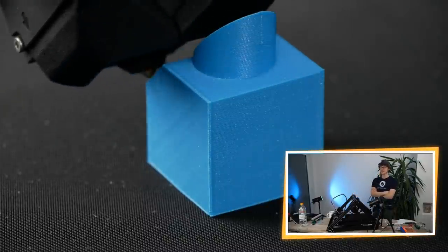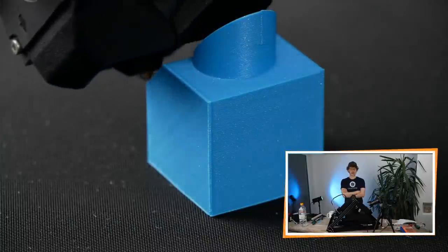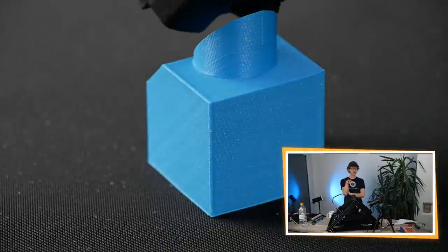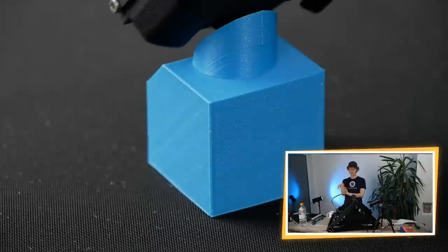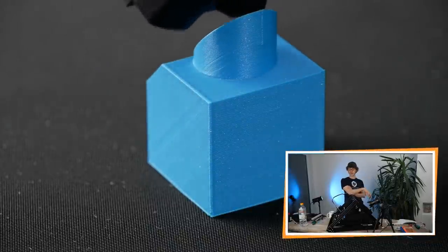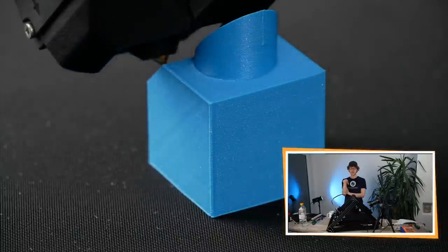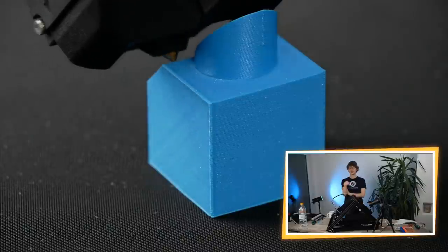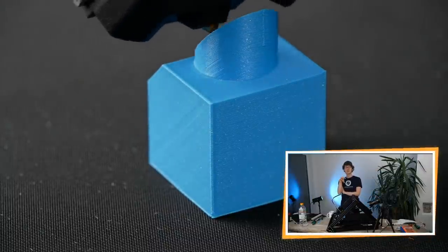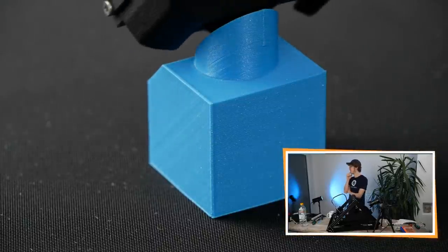The applications I would have for such a printer would not be printing really long parts. I see my use for such a printer in serial production, repeatedly printing parts over and over. So for this reason, I would rather have a normal Cartesian printer with ejecting print platforms or something like that than a tilted belt printer, due to the limitations I think you might have with that configuration. But as I said, I still need to really dig into the design restrictions and also the tricks that you can do to create equally great looking results with such a printer in comparison to a normal Cartesian 3D printer.